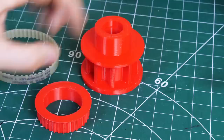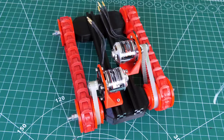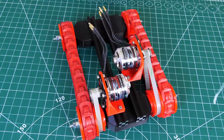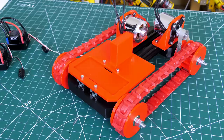Now it's time to try and drive these wheels. I've left a little stump on some of them and I've got a pulley that fits on there — it'll be glued on, and I always do these separately so I can change or resize them later. That'll be driven by a T5 belt. I've added two high-powered brushless motors — Turnigy AeroDrive 5055 280kV motors, previously used to power electric skateboards, so this is completely overpowered at about 1,500 watts each. Eventually for robotics I'll use worm-gear DC motors of around 20 watts or less. For now the motors are too big to fit next to each other, so I've got different length belts to reach each side. We're going to put some electronics in and power these up.